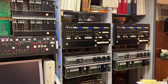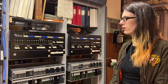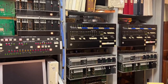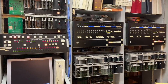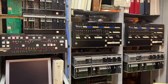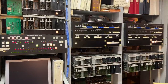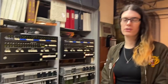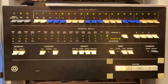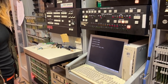I call it Cylons — it's not exactly Cylons, I know. The first indication we have of a successful boot is the machine will release a couple of relays under program control. Haven't heard that yet. That's a slow count. And now we're processing calls — however, we're not done. Now the machine is woken up and it is printing a list of its complaints to the teletype.